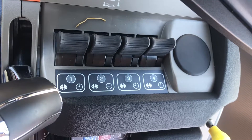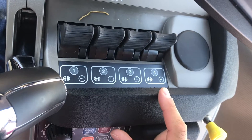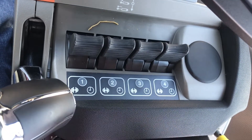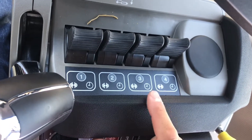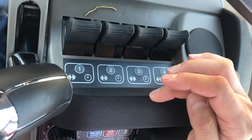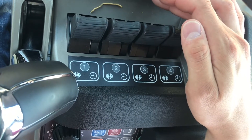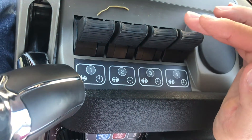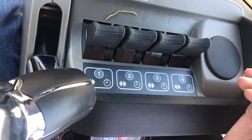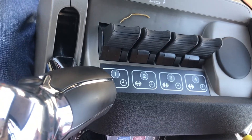Today I'm going to talk about another way to set your timers. You can use remotes 1 through 3 by pressing and holding the button on remote 3. The orange light will turn on and then start flashing. Then you can run your remote back for as many seconds as you want, and then run the remote ahead for as many seconds as you want it to be ahead, then back to neutral to set the number of seconds for that remote to extend and retract your hydraulic remote.